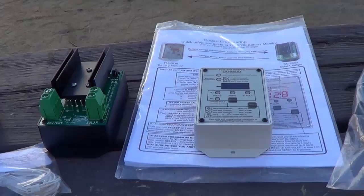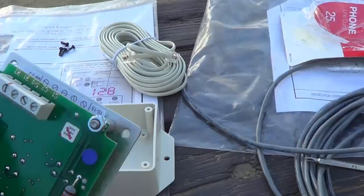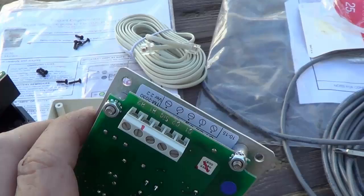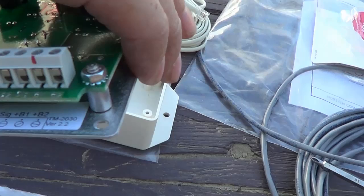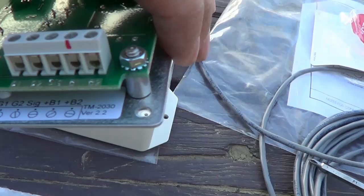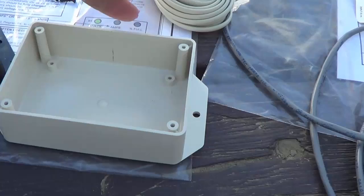It's best in your RV the way you're going to mount stuff. So let's just pop those boxes apart and give you a look inside. There we go — they pop apart with four screws each. There's the monitor board, and on it it's got a telephone jack and also these screw terminals. That's where you insert the wires that are going to go back to the batteries and the shunt. They're all labelled in there — you can see G1, G2, signal, B1, plus B1 and plus B2. The plus B2 is if you want to monitor a second battery bank, but I'll just be doing the one. So I'll only use four wires. You can see the plastic case so I have to drill a hole so that the wires can fit through.